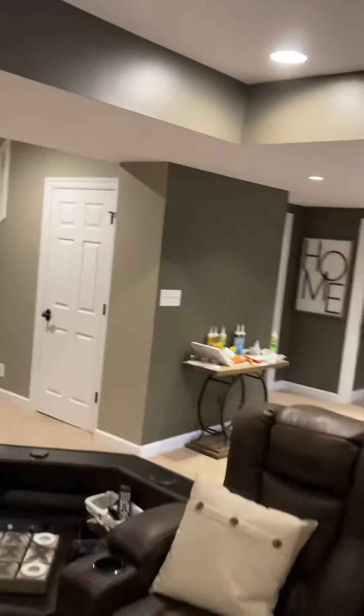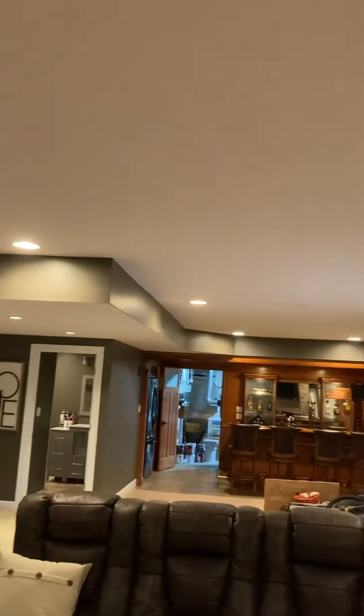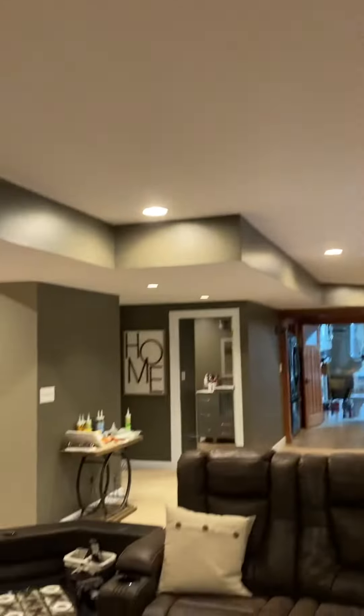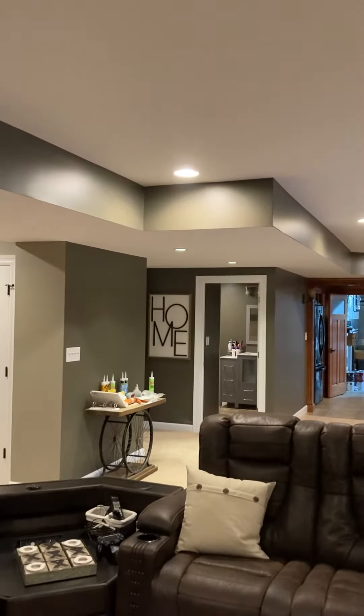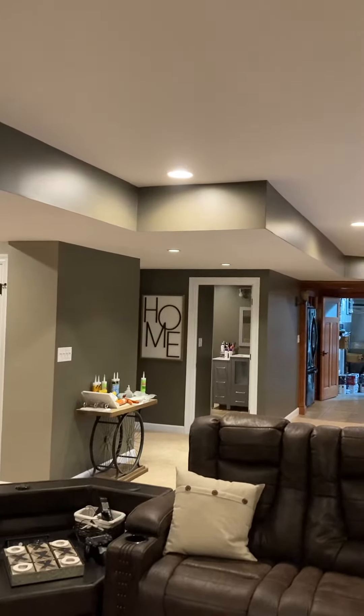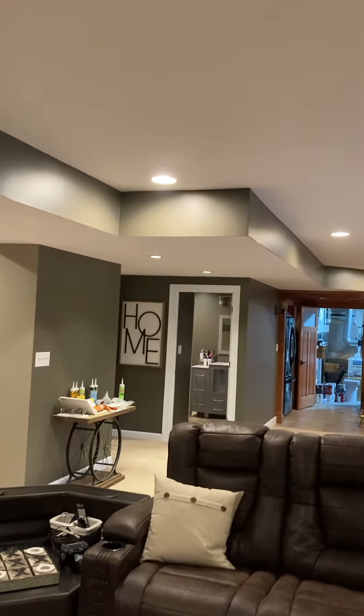As far as the supply trunk goes, you can see it's a finished basement, so we'll need to cut into the supply trunk. We had two on the outside and then we could get another one kind of in this middle area, either off the end or under the bottom of the main trunk.